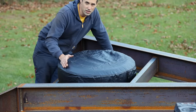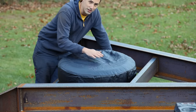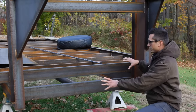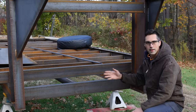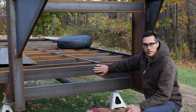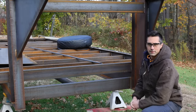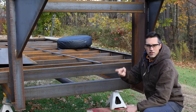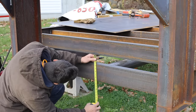The reviews for this tire cover said to go one size smaller than what the measurements say, and that's what I did — I'm really glad I did because it fits pretty well. So next I want to build a toolbox for the trailer. It's going to be right inside of the frame rails and it is going to be structurally integrated with the frame, making it stronger. It also uses the sides and some of these members to make up the back of the toolbox so I have to use less material. There will also be a secondary toolbox up there, primarily to store the battery, the hydraulic pump, and the winch.